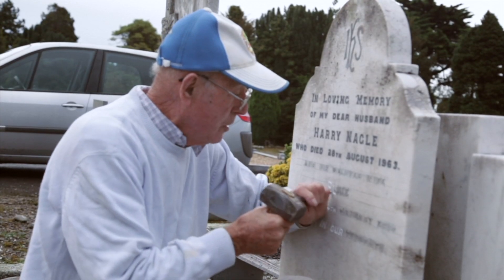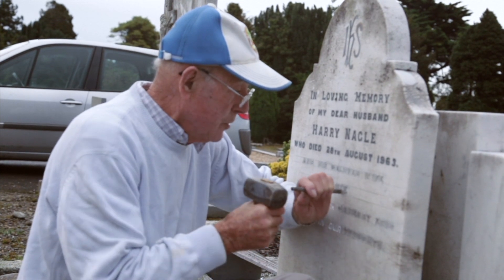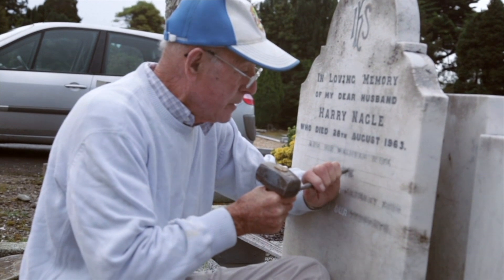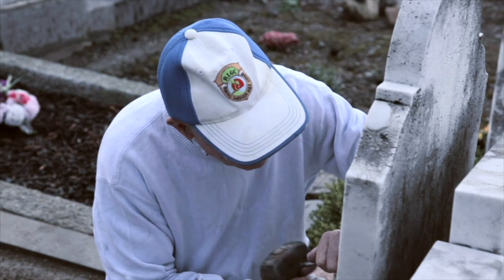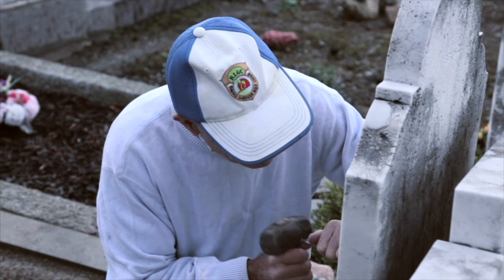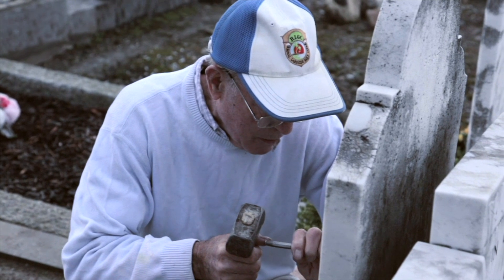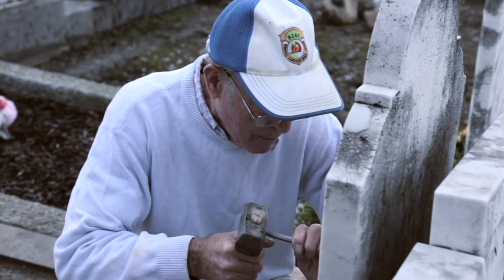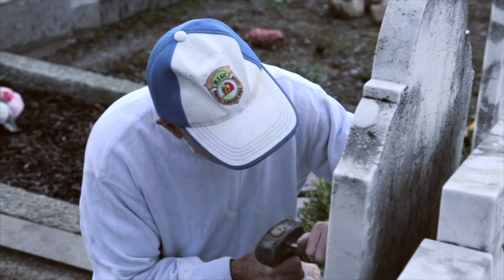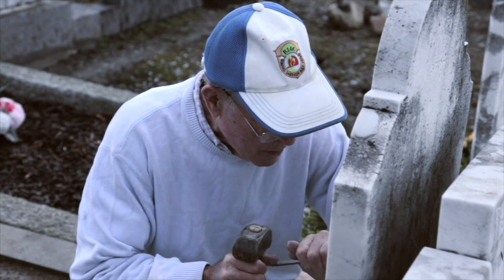All the rubbing of the stones would be done by polishers, all the macing would be done by stone cutters, and all the engraving would be done by monumental sculptors. But sandblasting has come in in a big way, and the majority of monumental yards do sandblasting now. There are very few hand-cut letters anymore. It's much more expensive to do them by hand than with a sandblaster.